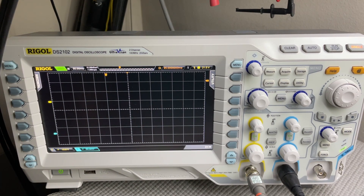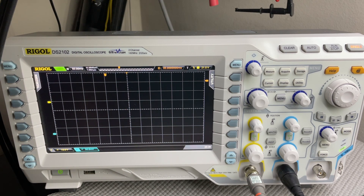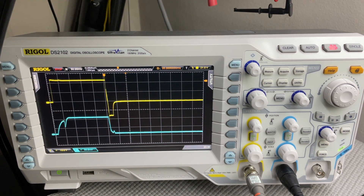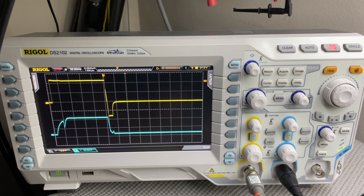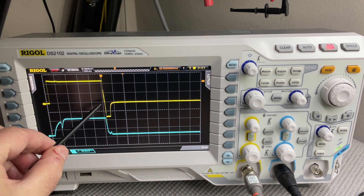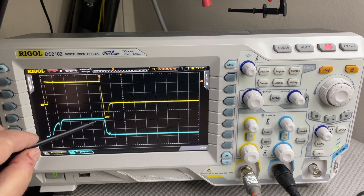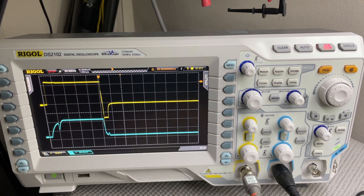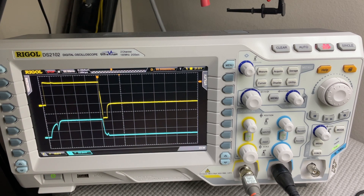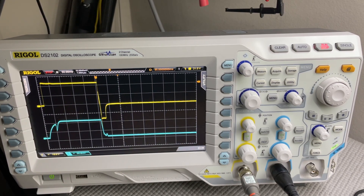In this setup it's exactly the same as before, except I placed a 15-volt zener diode in there, simply to show that although we've limited back EMF to 15 volts, we have stretched out the magnetic field collapse time. We've also stretched out the time it takes for the current to decay to zero. Again, we see the blip in the current due to the induced effects of the changing inductance when the armature moves in the magnetic field.